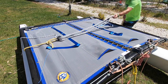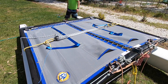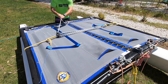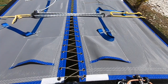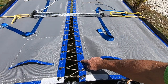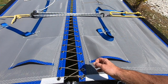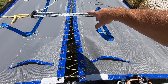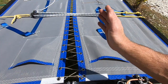Hook or tie it to the mainsheet at the top, then sheet in a bit — what that's going to do is bend the sidebars inwards just a little bit, taking the strain off the trampoline as we tighten it. Just a few small points: especially if you have an older boat, pay attention to the cringles when pulling the rope to make sure they're not pulling away from the cloth. If they start pulling away, just back off a little. Not all boats will have the same gap between the pieces, but a wider gap is not a problem.